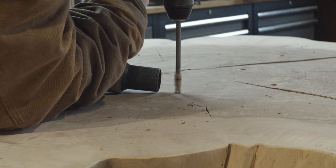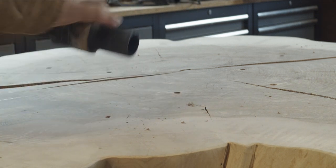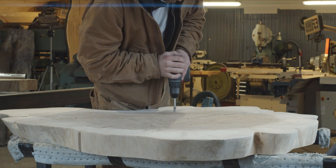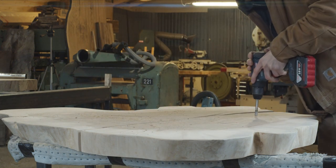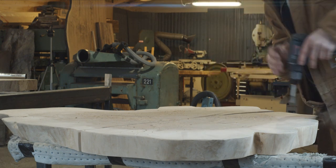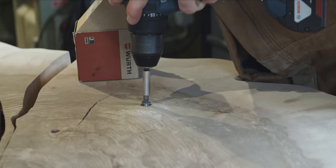I will drill 8 holes on the bottom of each tabletop. These holes will receive threaded inserts, which is what I typically use to mount table bases to slab furniture. A little trick I use is a basic tap for metalworking — although the pitch of the threads on the tap don't match the pitch of the threaded inserts, tapping all the holes prior to installing the inserts does prevent the insert from causing a split in the wood, which can sometimes happen when the coarse thread of the insert cuts its way into a hardwood like oak or ash.